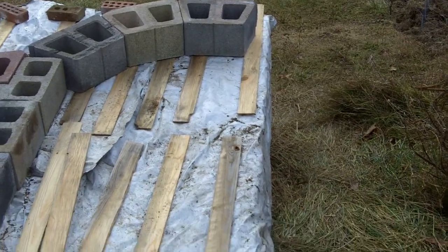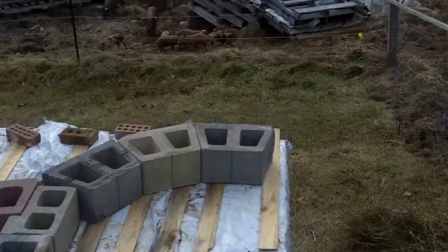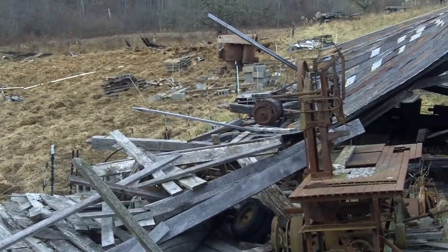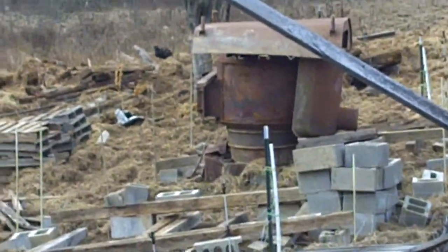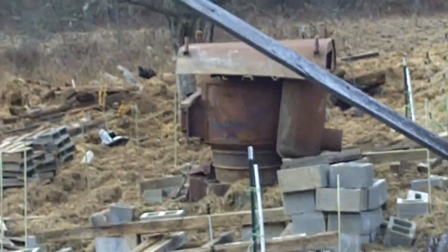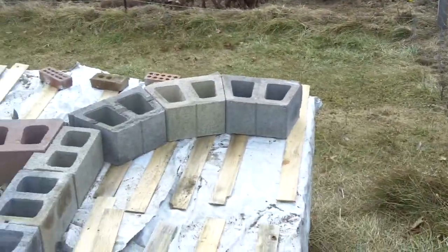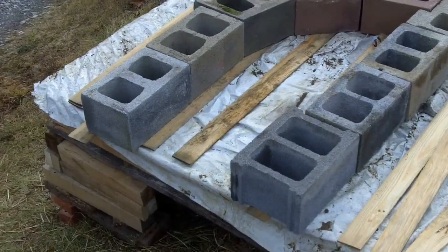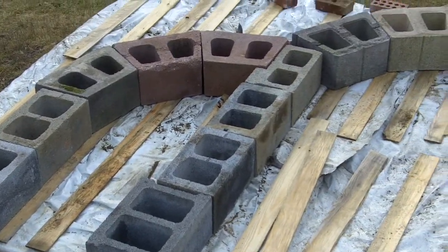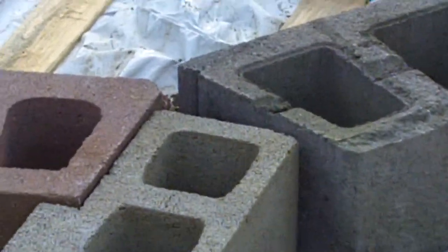The whole thing's purpose is to span a furnace. I can show you — it's over there, and I need to move it a little bit. That tank on top was just an experiment to see what it would be like to try to hold the heat down, but I decided since I have this material, I would rather do it with these blocks because they'll make tremendous thermal mass. It'll be a total of four arches, so I'll have to build eight of these. There'll be very, very little mortar involved — just a little bit right there, which I can pour in place as concrete.